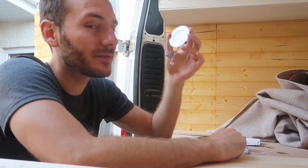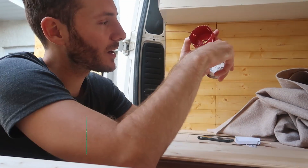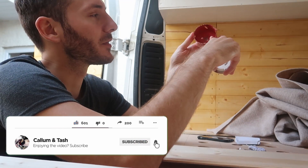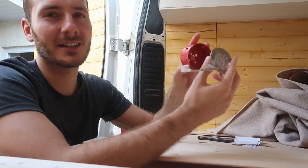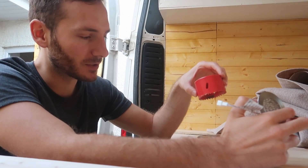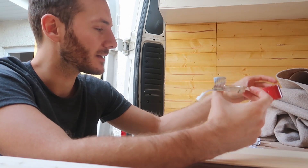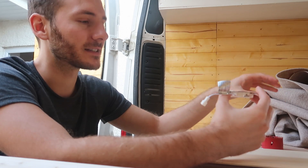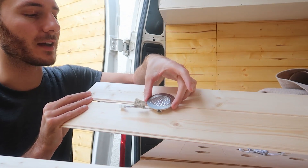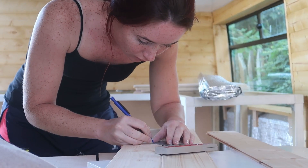So these are the lights that we're going for. I believe they're attached, though I honestly can't remember — we've got a switch anyway just in case. We were going to use one of these circular saw attachments that you just put on a drill, but the closest size to the light is a bit too big. So I thought we would simply pop a hole in the cladding and fit the light in, but it's going to be too loose. So what we're going to do instead is get two bits of cladding and fit the light in the middle — cut half the circle on one bit of cladding and half on the other.